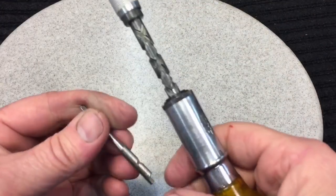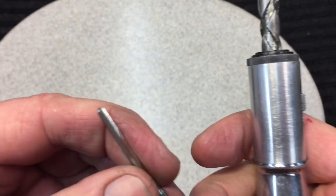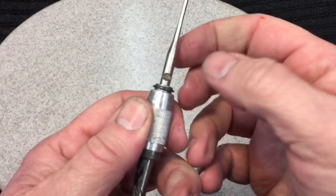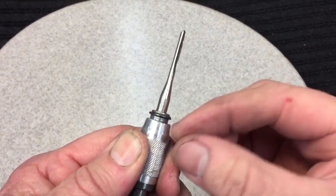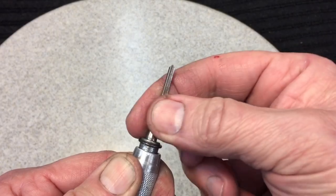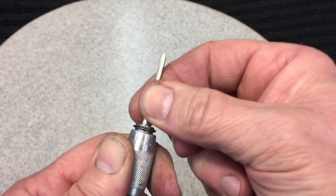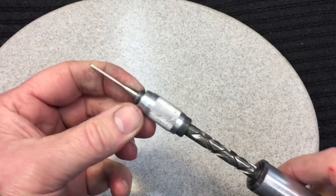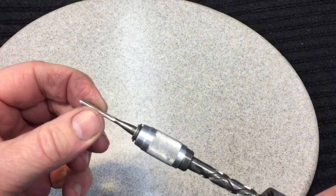Many of these types of screw drills work the same. And you can see this is the type of bit they take. This one here is a drill bit. What you do is you place it into the top here and you pull back. And when you pull back, there's a spring. You might have to collapse the drill. There's a spring here that when you pull back on the collar, it'll allow you to place this in and you just turn it until it locks. You'll see it'll turn and then it'll lock in only one position. Then when you let it go, it is in there. It can't come out. And to release it, you just reverse it. You pull the collar back and slip it out. But you do have to give it that turn until it locks in.